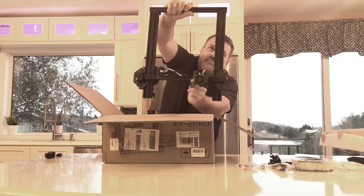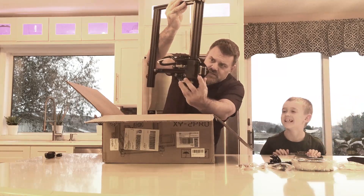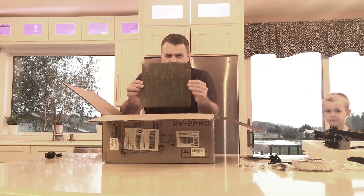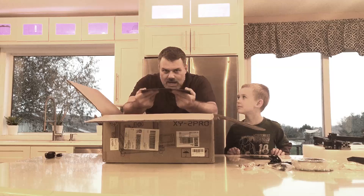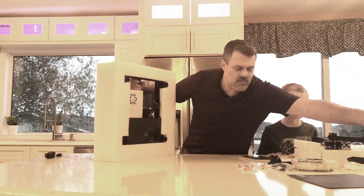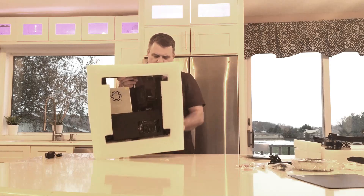Nice — it's 20 by 40 millimeter extruded aluminum V-slot. Most of this looks like a clone of Creality components, but there's one big difference: there's a serial-type adapter for all the connections, so a single plug-in for everything on the gantry. And here's what really peaked my interest — a flexible bed. After you're done printing, you unclip it from the bed, pull your print up, and pop it right off. The control unit and power source are built right into the frame, which I love — no separate head unit for the controller.